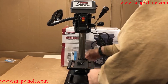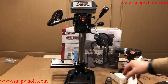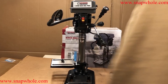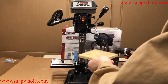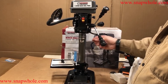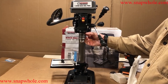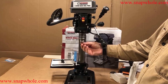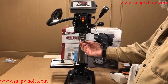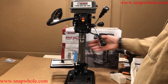Let me put this all the way down and move it out of the way. The manual says to put this on and hit it with a rubber mallet, but you should actually put a piece of wood in front of it anyway. A drill press is made to put force down, so those two mate together. If you put something on here like a drum sander, that could put sideways force — I've seen these chucks fall off with a sander, so just be careful if you're going to use one.